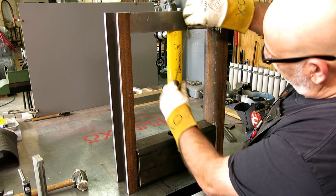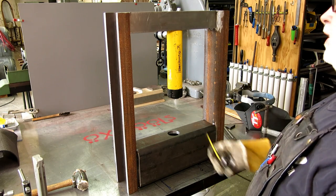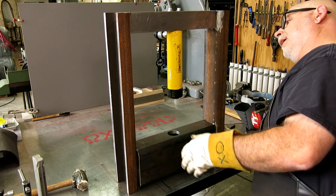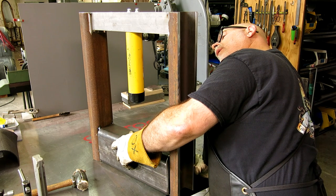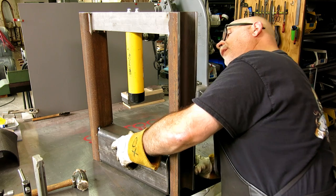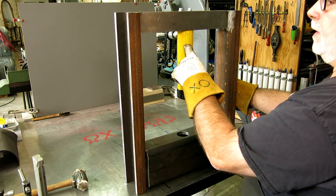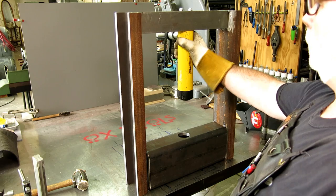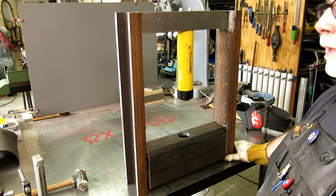Inches of stroke to there, and I think this is a 6-inch stroke cylinder, 6 or 7 maybe, I'm not positive. Sometimes you can tell from the part number. 700 bar RC 10-6. So I think it's a 6-inch stroke, so that's good. This is a 10-ton cylinder here, and so in a little bit, we're going to have a 10-ton scrap metal Dogmeat hydraulic press.